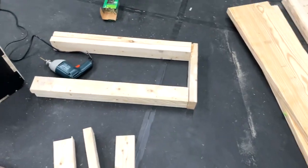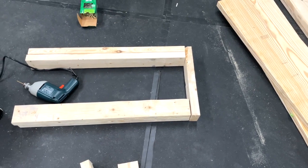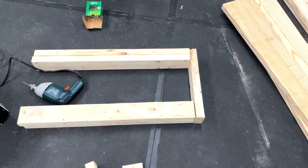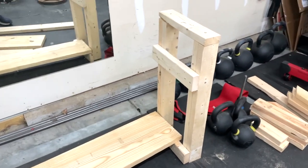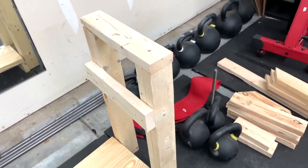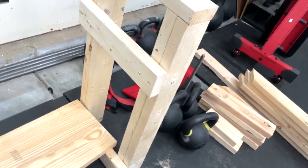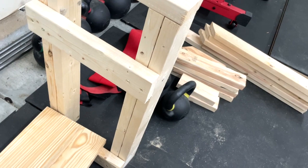I'm going to lay out what it's going to be for the side frame and give you a list of materials. I got the uprights all made — it's a 16-inch two-by-four — and then I got two 32-inch sections screwed together, and then 16-inch pieces right there.